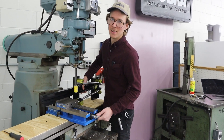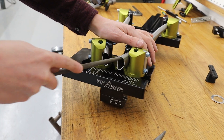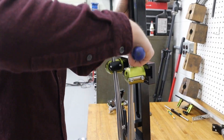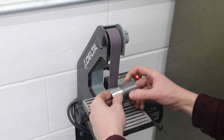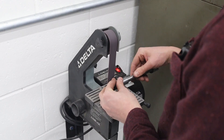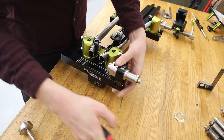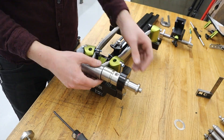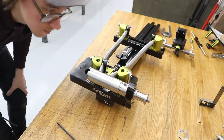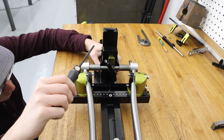I'm going to take these out of the mill, prep them, and we get to weld these puppies up — how exciting. I definitely want to deburr the tubes before welding. I kind of like knowing they're in exactly the same position before and after deburring, so I just leave them in the fixture. You just have to be careful with your hand filing. Here I'm getting these down to bright shiny metal, and then I load them up in the fixture. That's the sub-assembly mounting point — it's got an argon back purge fitting. It uses all the same bottom bracket adapters and shims and outside washers; it's the same ecosystem as the Creator frame fixture essentially.